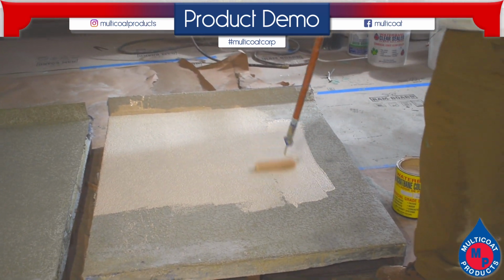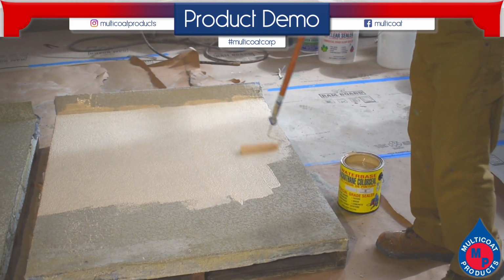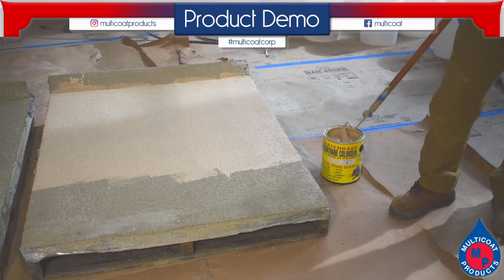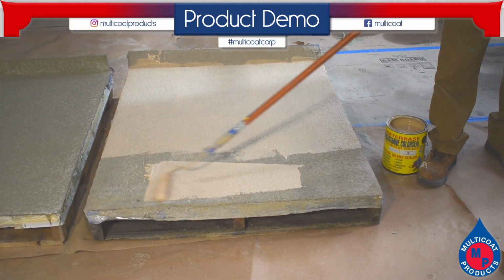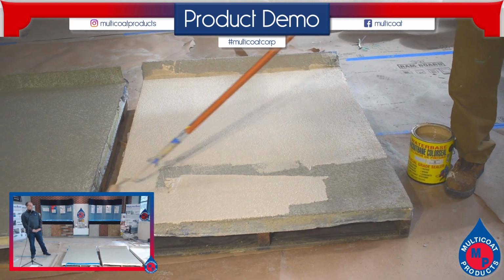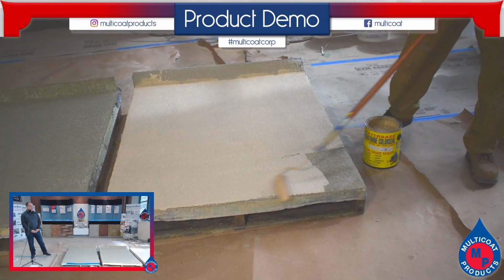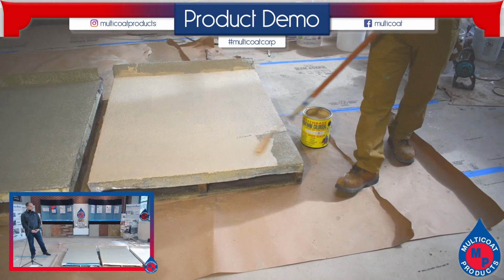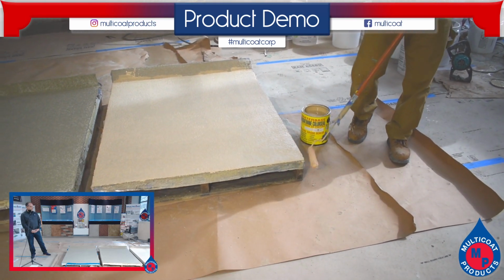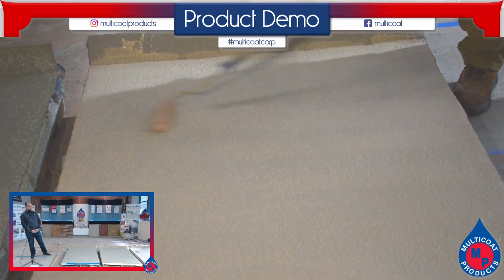We're using a really small roller here because we're using a 1 gallon can, but typically use a little bigger roller and a 5 gallon bucket. Couple secrets to making it last longer or get a little extra coverage: when you're doing your first coat, because the concrete will absorb a lot of the color, maybe on the first coat, mix it 15-20% water, and then on the second coat just use it straight out of the bucket. Right now we're just going to show you 1 coat, but we typically recommend 2.